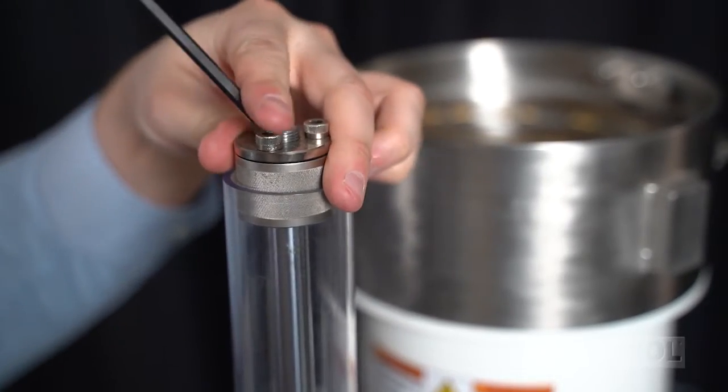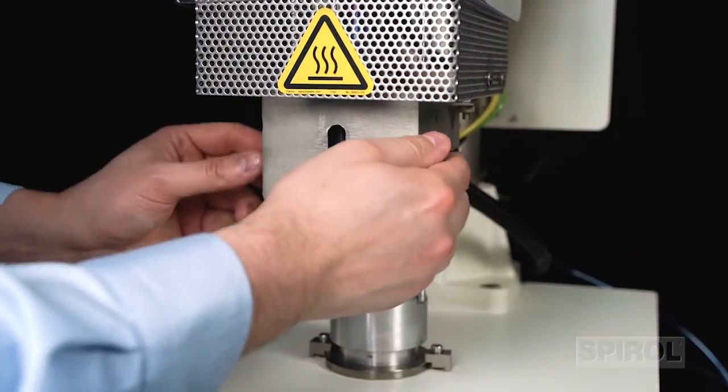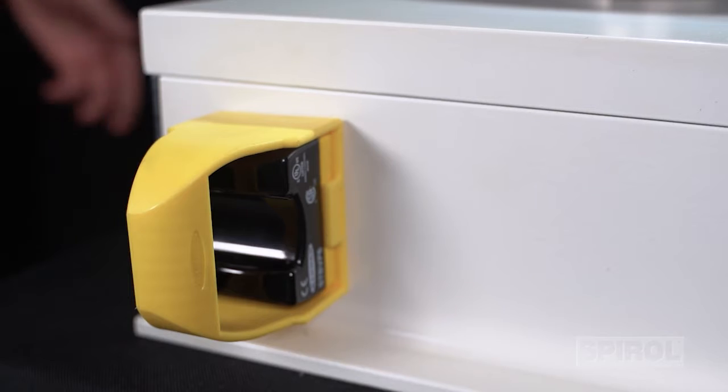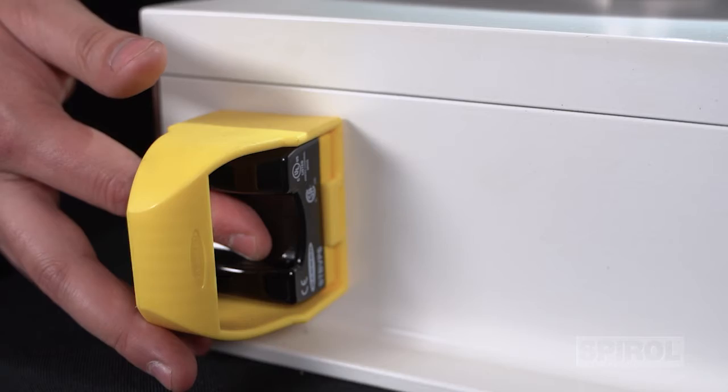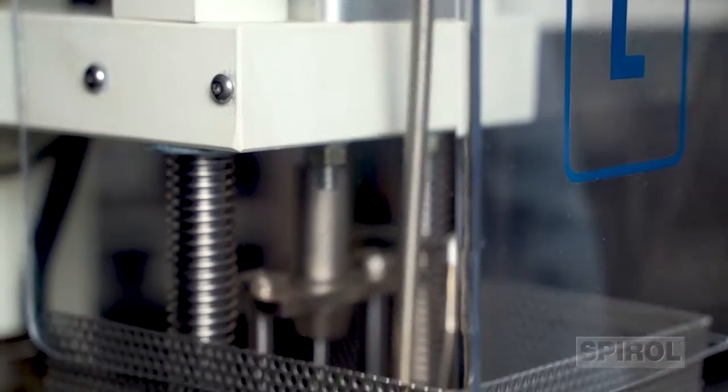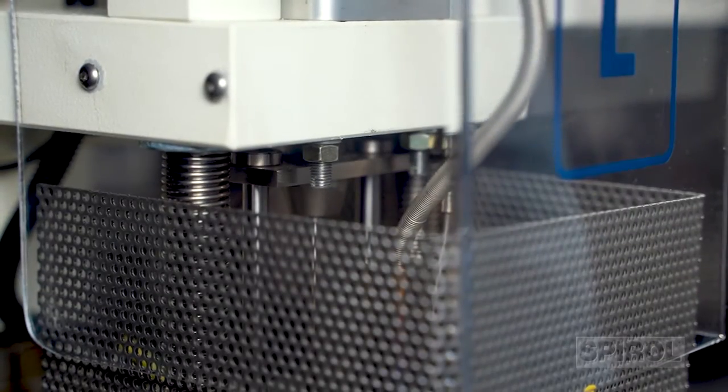Additional standard features include fine installation depth adjustment, a quick clear orientation head, and all inserts in the installation circuit can be removed without the use of tools. Anti-repeat dual optical touch actuators provide safe and easy activation, hardened insertion quills offer long life use with minimal downtime, and a cushioned cylinder return stroke delivers lower noise levels.